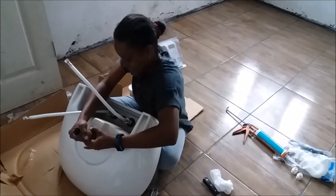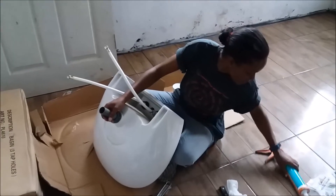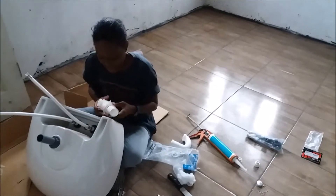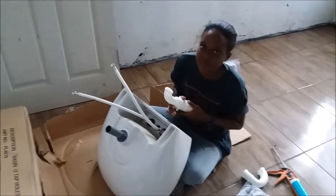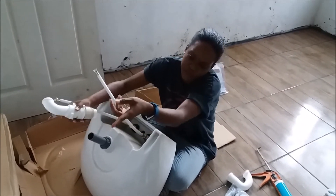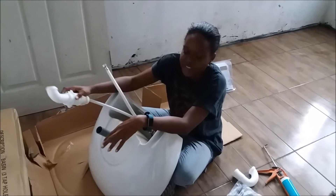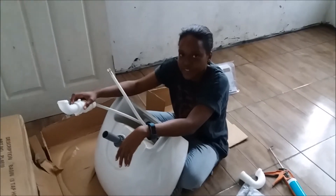So the pop plug is in. What screws onto that now is the P-trap. I'm going to attach the adapter to the part of the wall and then attach this part. Next we're going to cut those pipes on the angle valve and put on the connections, then attach everything together. We need to put up the molds on the wall first and then attach everything.